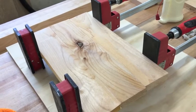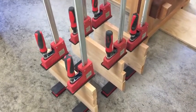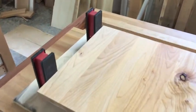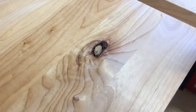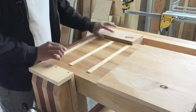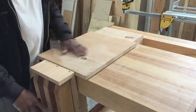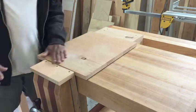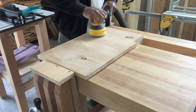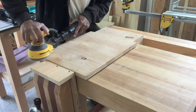The only other thing I had to make sure of was that I had a wood knot in the project. I glued up three sets of boards and after they dried, I chose the two that I thought would work best. To help with sanding, I cobbled together a little jig — an L-bracket that hangs over the chop with a leather or cork strip glued in place. I don't have any dog holes in my bench top yet, so this really helped me hold the board while sanding. After just a few moments, the snipe lines came right out and the surface flattened out nicely. There was a slight bow in the board, but it was barely perceptible.